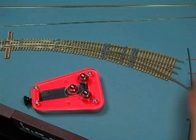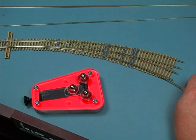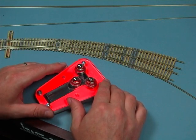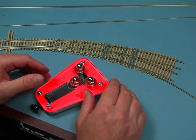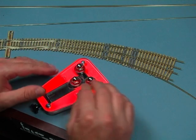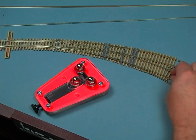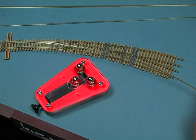When I'm bending rail, I use pretty much a trial and error approach — I'll bend it and see how it matches. This is tighter than the inside race but pretty close, and that's what you're trying to achieve with the rail roller. I usually look for a small, medium, or tight bend depending on what I'm doing. I'm not trying to hit a precise 32-and-a-half-inch radius, just a close enough bend. For this inside curve on this turnout, that would be close enough — it's got the bend in there that I'm looking for.